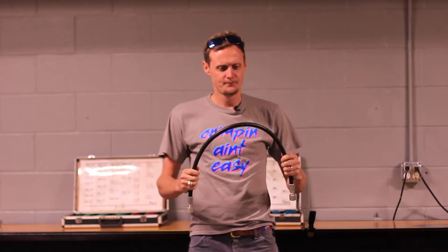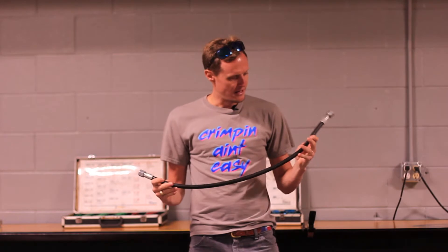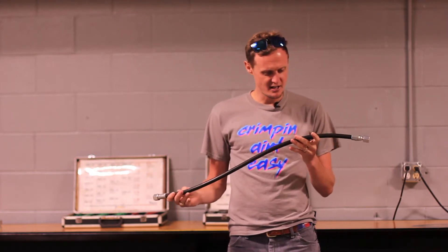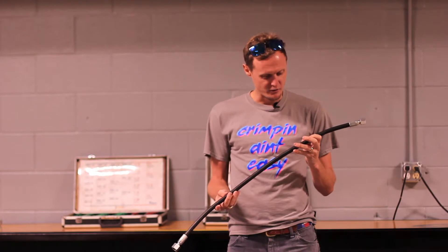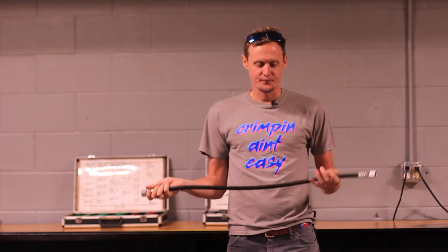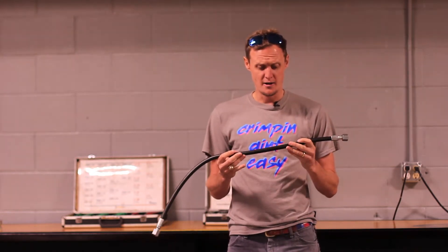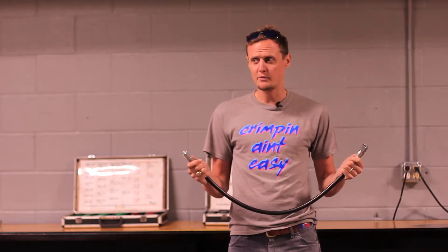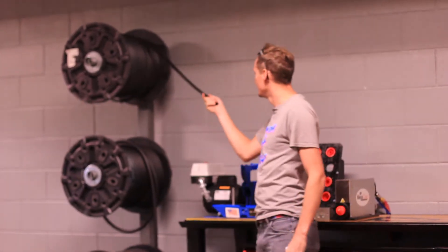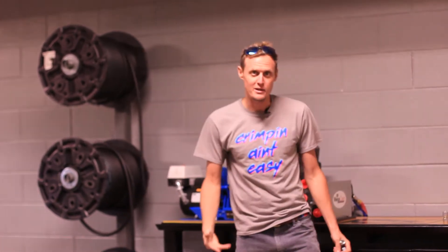First thing you do is look at the lay line, which is going to tell you a couple things: the size — this one is 3/8 — the pressure rating, 3,000 psi, and the SAE spec. The SAE on this one is 100R17. The best thing to do is make the exact hose you have, but there are a bunch of different SAE specs and you might not always have every one. A good rule of thumb is to go over on pressure rating — you don't want to go under. This hose we stock is 4,800 psi, so it's overkill, but it's definitely better to be overkill than under.